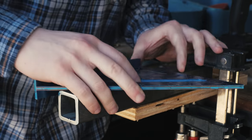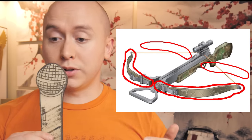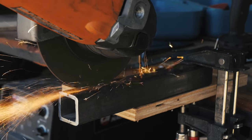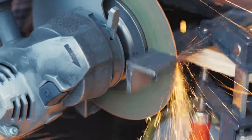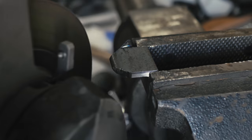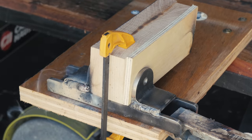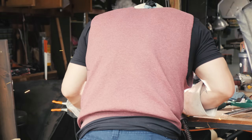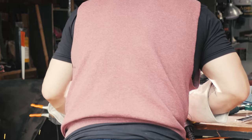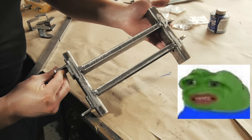Here I'm making a frame to hold what was initially going to be two limbs on the front and two in the back. Thankfully, even though I didn't go with four limbs, this frame still works with what I ended up doing. I split some square tubing in half down the middle to get a couple of U-channels — tubing I had lying around that was, purely by the grace of God, the perfect inner diameter to hold half of the leaf spring once split. I cut angle steel into four little brackets: two to attach the frame to the wooden stock, and two on the front to attach the stirrup. With those welded up and cleaned, I used a wooden piece matching the stock width to make sure the beams connecting the front and back U-channels are perfectly spaced.